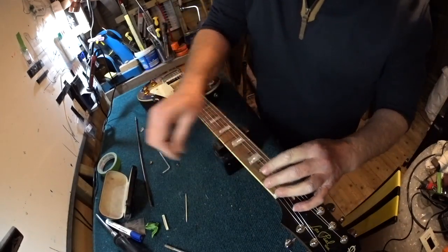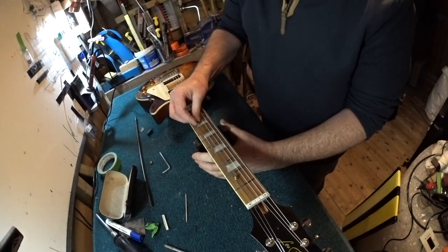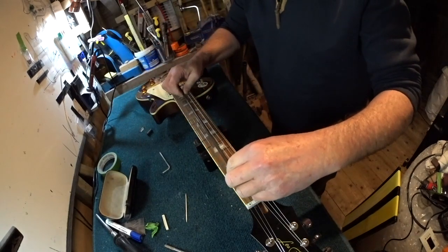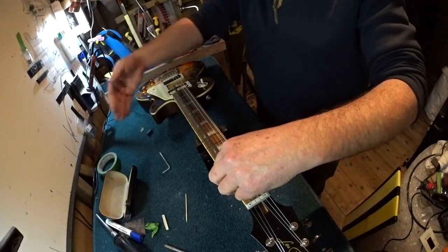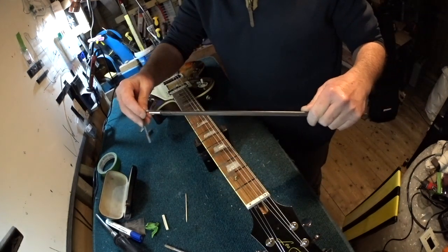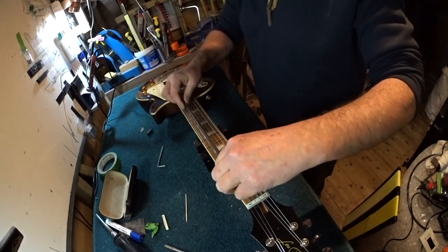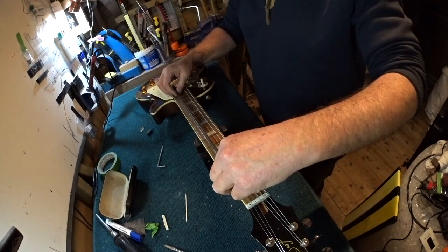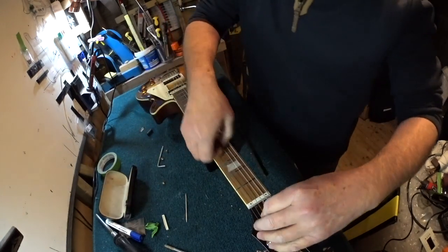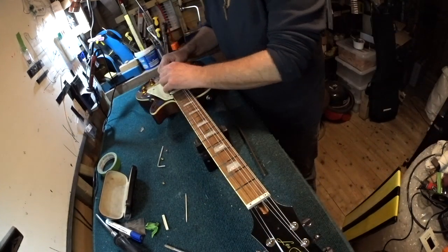So we're going to place the little grommets again, or what do you call them? Dome nuts. And this time we're going to recalibrate, as I always do, to the outside of the track. And this now is a little flat, so we're going to put a little bit more curve into this rod with a tiny adjustment. And the adjustment only has to be absolutely minuscule, and that is now spot on. That judgment about the curve, by the way, is one of the things that you really will get with a bit of practice.